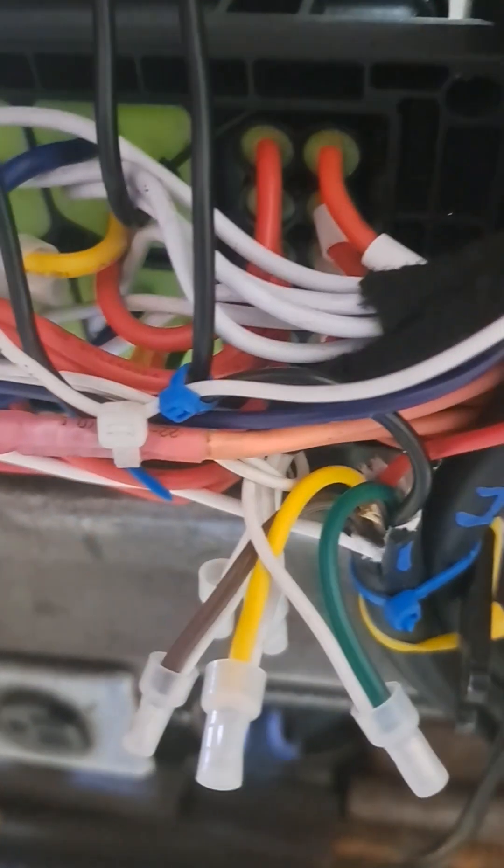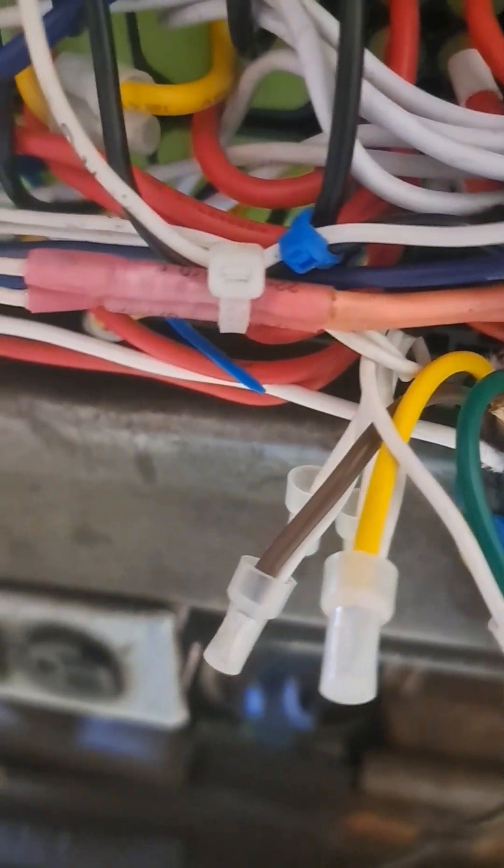Also, cheap remote. I made it modular, so if we need another remote it'll be easy to wire in — just new terminals. The butt connectors I put in the whole rig are right there, and that's your fuse power supply to the receiver. Some wires I needed to run back the other way, so I butted them like that. Some of them are just wires that aren't used — they're just capped off.